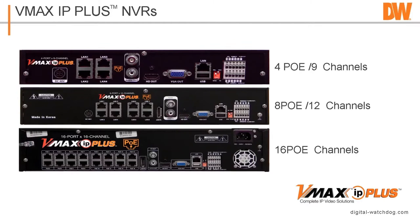So let's say you went out and did an installation and you put in 4 cameras for a guy and he just wants one more camera. Now you've got to negotiate, take back the 4-channel unit, get an 8-channel unit or whatever. With the 4 PoE one, you don't have to do that. With the 8 PoE one, you don't have to do that. Just introduce another PoE switch and you can support another couple of cameras. In the case of the 4-channel, you can support up to 9. In the case of the 8-channel unit, you can support up to 12. The 16-channel unit is a 16-channel unit.